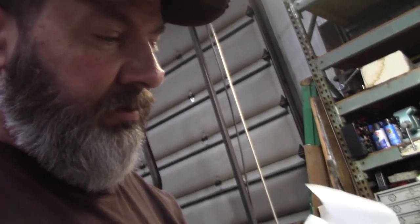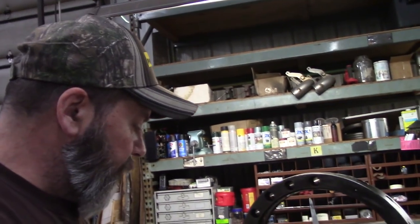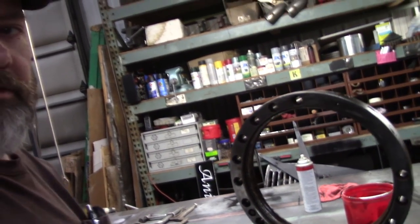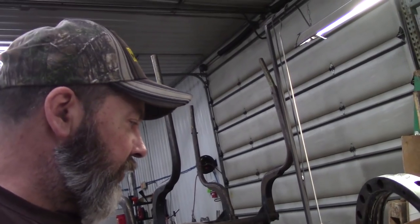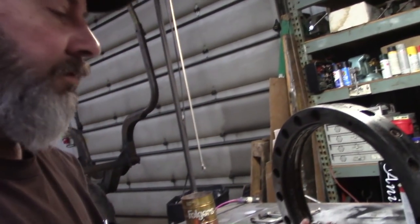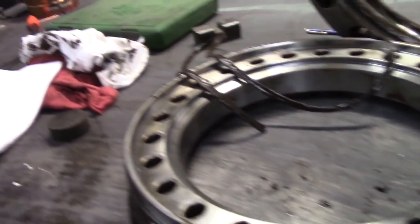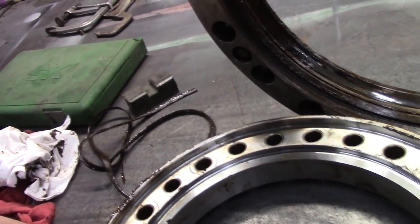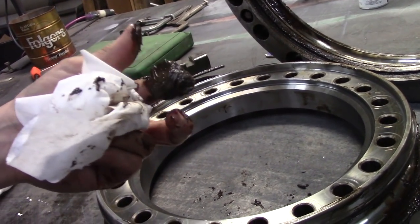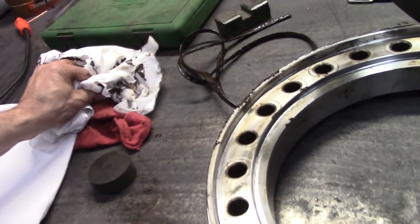Because these things are expensive — you're talking anywhere from $3,500 to $5,000 for these things, and then the big ones like on that Temco. So at any rate, that's my little spiel. Hope you don't mind me taking a bearing apart. I wanted some marbles anyway, because I lost all mine. Take your grease fitting out next to it or opposite it and get grease in there. You can tell — I'll just do one more demonstration here. You see how brown and crappy and rusty that is? And not anywhere in that whole thing that I just wiped off did I find any fresh grease. None. Nothing against the operator — that's just old. Gotta get that crap out of there and grease these things — it'll last a lot longer for you.